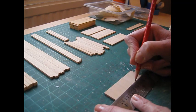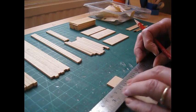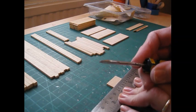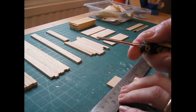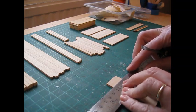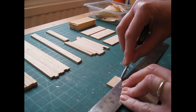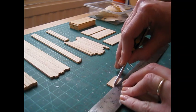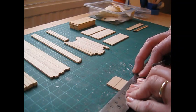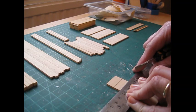Do that on each edge of the wood. Turn it around and place the steel rule just below the pencil mark — that will allow for the thickness of the screwdriver. Use just the very corner of the flat head. Hold on to your rule and then do a light score across the piece. You can do a second score just to make it slightly deeper, but always do the light score first because otherwise it tends to go off track and jump into another groove of the wood.